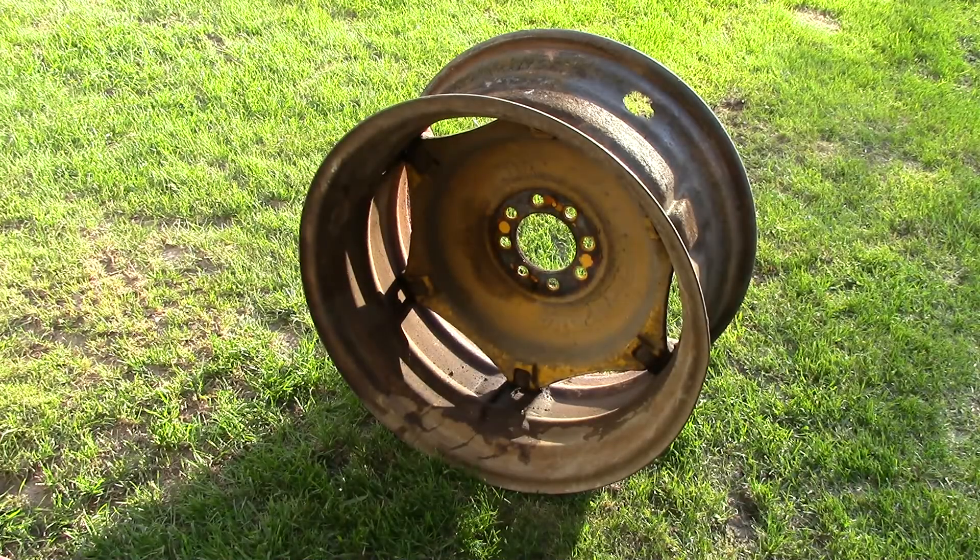In this video I'm going to run through a repair of a rear tractor wheel. As you can see, this one had an inner tube in it, which most do. A lot of times they use a solution which is calcium chloride inside of the inner tube, and over time if the inner tube gets a hole in it or the valve stem gets a leak, it will eat out the valve stem hole in the wheel. The hole inside of the wheel gets all rusty, so basically you can see the hole that's in this wheel that I will do a repair on.